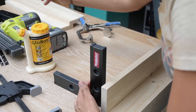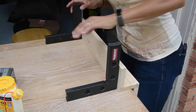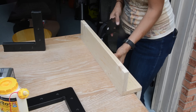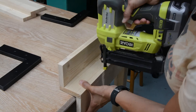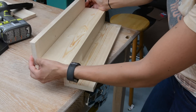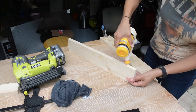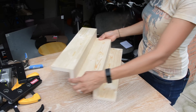The only thing I had to do was cut the boards to size. I used squares to make sure the boards lined up as perfectly as possible — I wanted the stair steps to be exactly 90 degrees. I really relied on my brad nailer because that was the easiest way to join the boards together. You also want to make sure you have a wet towel to wipe the glue. I was going to be staining this, so any extra glue on the wood needed to be wiped off — otherwise your stain would not set. Here I'm just gluing the final pieces and creating this stair step.